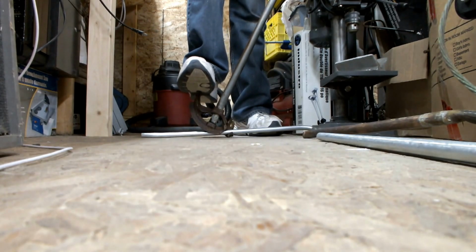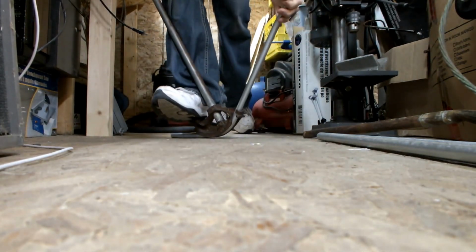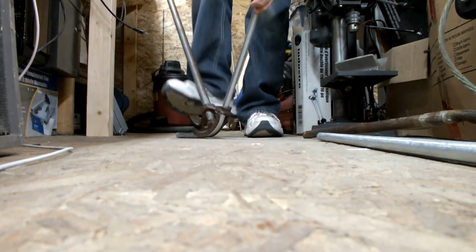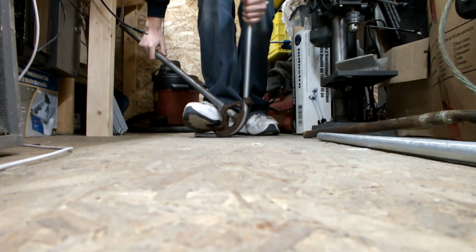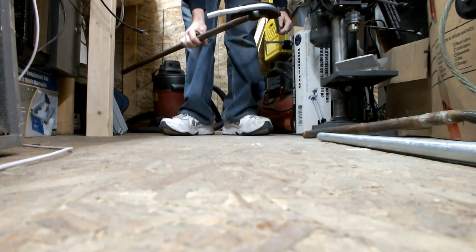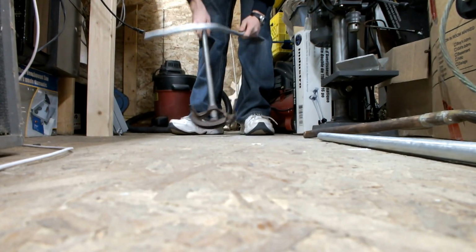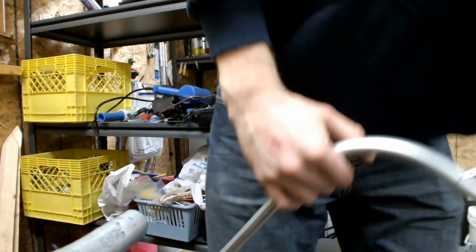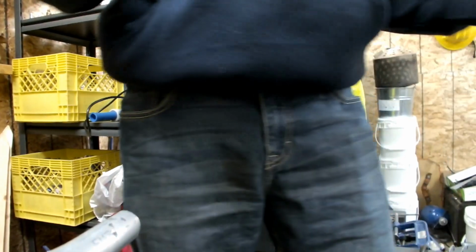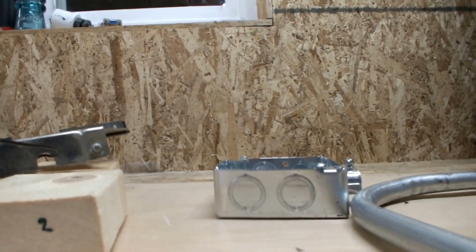and then keeping the gripper in there, we're just going to push down on this until we get to 90 degrees. With short little lengths like this, it can be kind of hard to get the amount of weight you need. And then you can take it out of the shoe, and everything is lined up. Now that that's out, and it is bent the correct way, let's see how it fits.